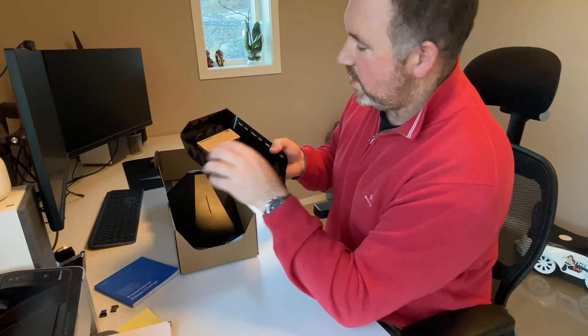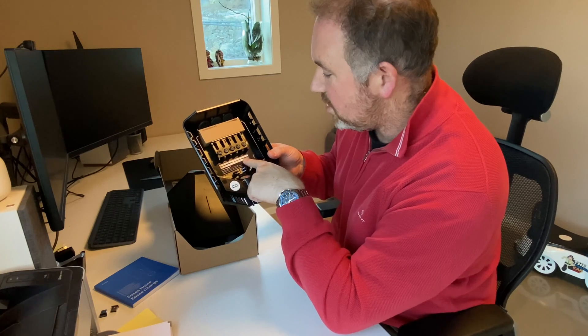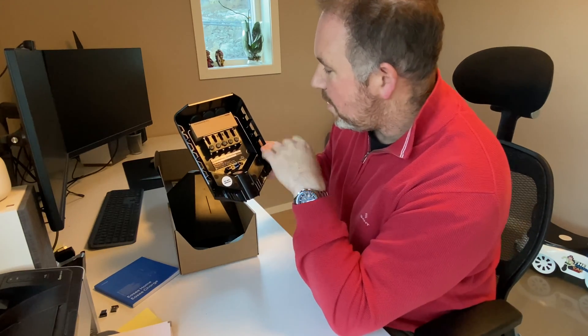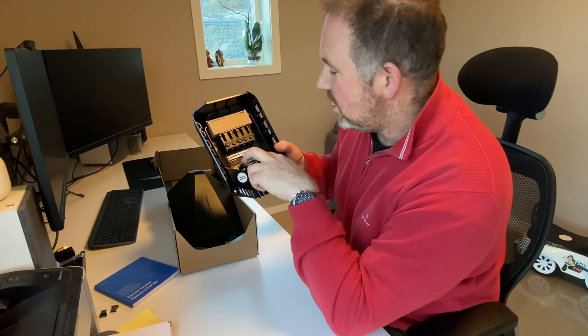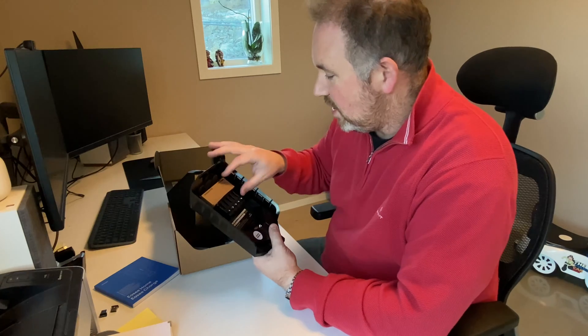Inside here is your connection area. Whether you have a 400-volt TN or IT system, you follow this path: for TN you have the neutral and L1, L2, L3; for IT you have just L1, L2, L3, and the earth. I'll install it with TN and a 32-amp fuse, so it will take up to 22 kilowatts — that's the maximum. My car only supports up to 7 kilowatts on one phase, so this charger is much stronger than the car needs, but you never know when you'll get a new car, so I'm just installing it the full way.